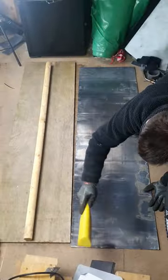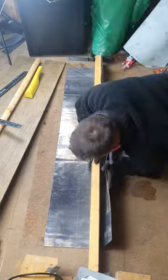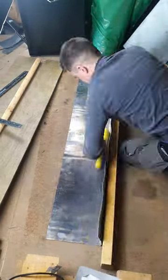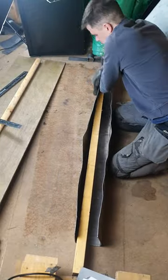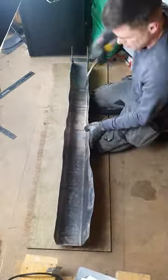Attempt number two making this ridge lead piece. I flattened it out with the banana thing and marked on the bend lines. Then I made those bends using a bit of wood and just bashing the lead against the wood. Then I put it on a piece of ridge roll that I attached to some plywood.